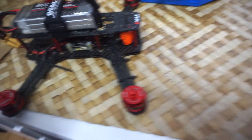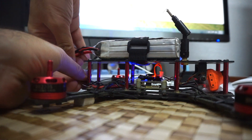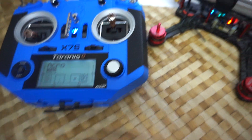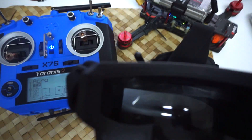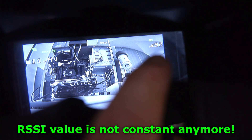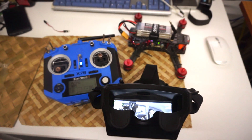Writing is finished. Power off the radio, remove the receiver and cable, and insert the receiver into the drone. Power it on, then power on the radio - the red LED should turn green, and it's green. Power on the goggles and check the RSSI value in the corner. It's no longer a fixed value - it's moving and changing. That confirms the fix worked.